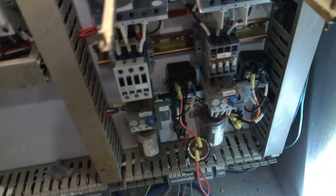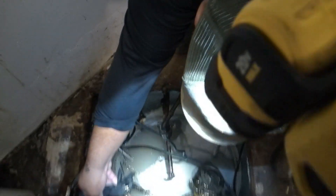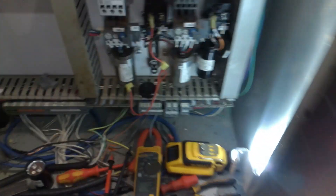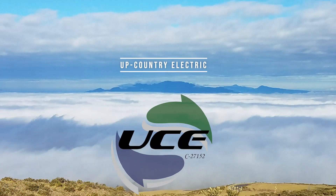Power back up, let's get amps. Way better — six amps. You want to look in there and see if the level's going down? Six, 3.4, and seven — that sounds more like it. You can see it dropping. Shut them down, put this one back on number two — two is back in action. And one just needs a new capacitor. Perfect.